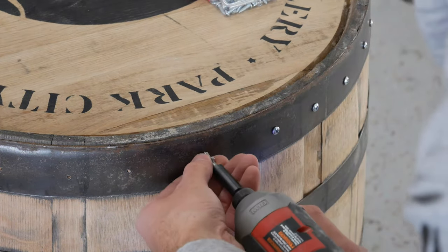It's getting time to wrap this project up. The barrel is all stained and now also finished with a sealant. I put three coats of the sealant on — between each coat I did a light sand with the 220-grit sandpaper — and I think it turned out really good. The next thing we need to do is install the shelf in the barrel. Once the shelf is installed, we'll be mounting the door. We'll be using some shims to shim the door up, put the hinges on, then a handle, and maybe a little magnetic piece to help the door stay shut. And with that, we'll be wrapping up the project.